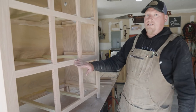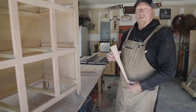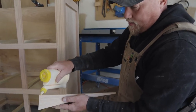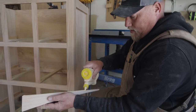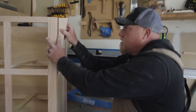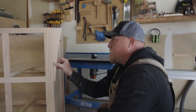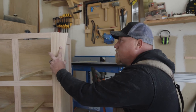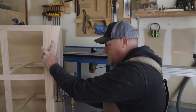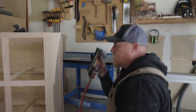We've got all of the face frame pieces fastened to the cabinet. Next thing we're going to do is put the accent trim pieces on the upper corners. I'm going to fasten these pretty easily — just put some glue on the back, and where they go in the corner, I'm going to use a special brad gun that shoots a headless nail, so after everything sets up you won't see the nail. It just has to hold it until the glue dries.